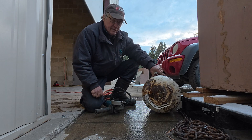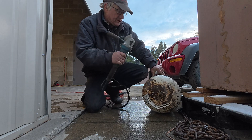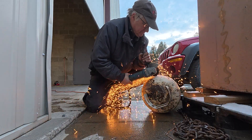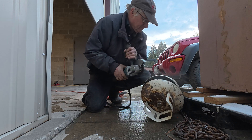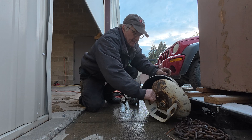I first filled it with water just in case. I dumped all the rest of the propane out, filled it with water, and then just ground the top off like this.